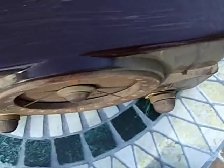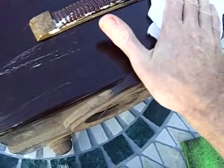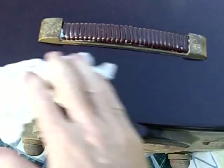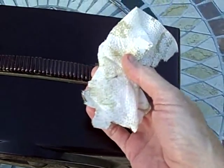It's not going to have a shine because the shine was removed a long time ago. Somebody must have cleaned this Bakelite with a harsh cleaner like Windex — anything that contains ammonia will devastate the surface finish of Bakelite. When Bakelite is made, it's a composition of solid fillers and phenolic resin. When it comes out of the mold, there's a glaze coat of phenolic resin on the surface, and that's where the original shine came from. Some of that brown is dirt, but some of it is deteriorated resin.